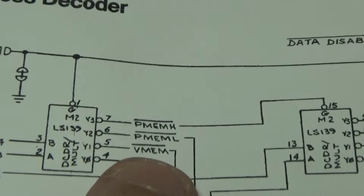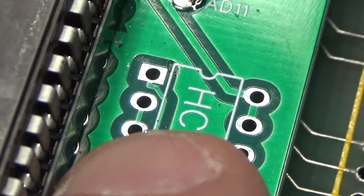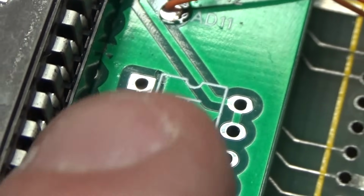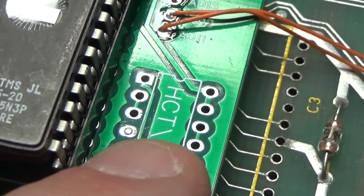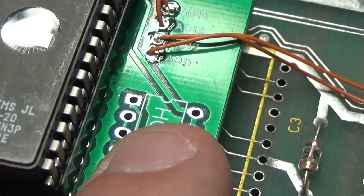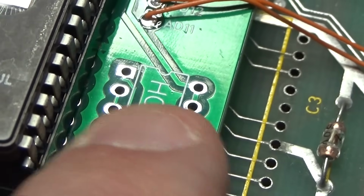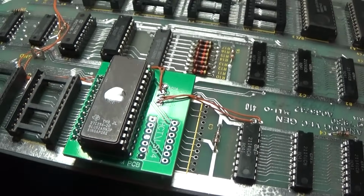So I'm going to find a good place to pick these two signals. I'm going to modify this. I pulled the 0 ohm resistor, and I'm going to place the 08 right here, and I'm just going to run wires over to it. I'm going to get my little Dremel out and separate all of these connecting wires. Actually, this side I don't care about. I'm just going to do it right here on these top 3 pins. And I know there's nothing on the back except for pin 4. Pin 4 on the back side of this runs to the enable. So I'm going to run the inputs to 1 and 2, and then jump pin 3 to pin 4, because that'll be my output going to this guy to enable it. But I have to get the Dremel out to separate these little interconnecting traces. So I'll put an 08 in here, run a couple of wires, and it should work perfectly after that.